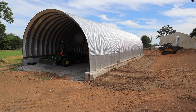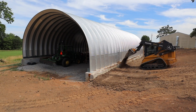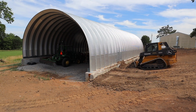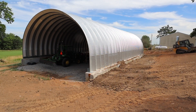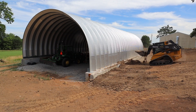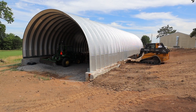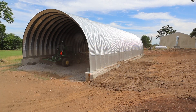My first inclination was to drive lengthways parallel to the building and just sprinkle out material as I went, but I quickly realized after one pass that that wasn't going to take off the incline. I would have just raised the ground level but maintained that incline. So I'm piling more material than needed up against the wall so that when I flatten it out and it pushes away, maybe it'll level out. We've got about 14 inches probably that we're trying to raise the ground level, so I did it in two lifts so that it could be packed in about every six inches like they recommend.